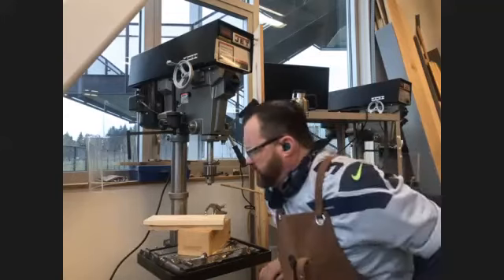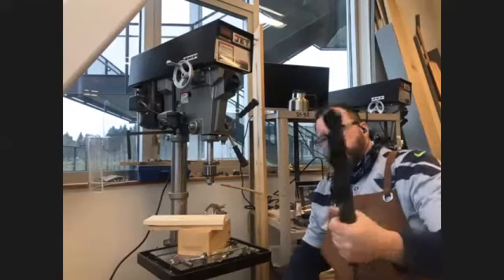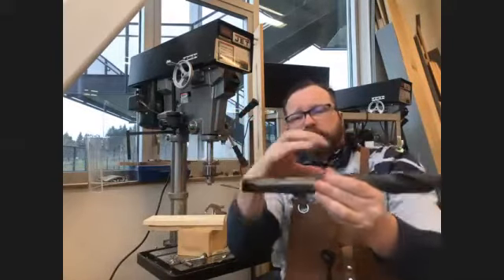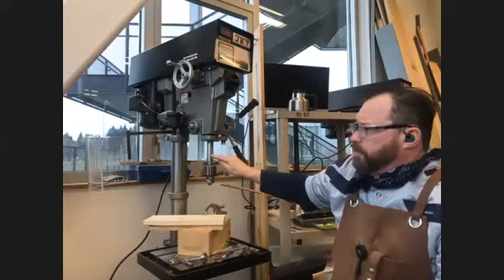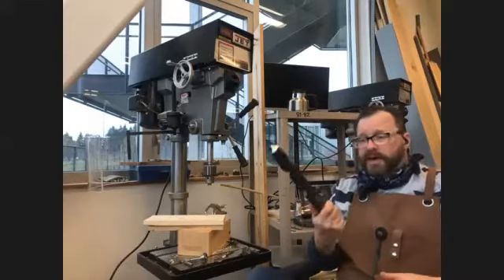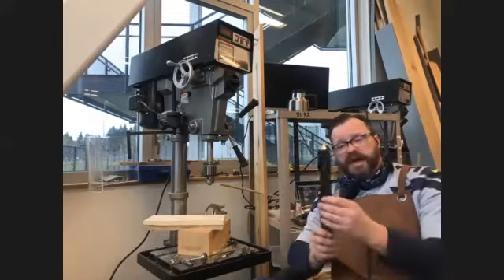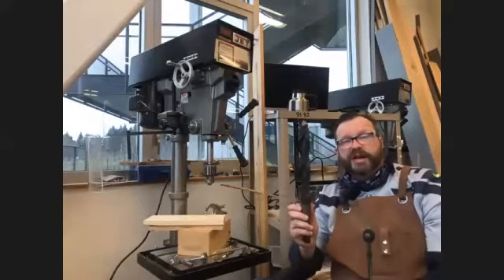There are many different types of drill bits. This large one is meant to go into a number two Morse taper — you can see it's larger and thicker here, so it binds into this portion of the spindle. My spindle is a number one Morse taper; I think this is a number two or three. This drill bit actually measures one and thirteen thirty-seconds inches, so it's really big — and probably a pretty expensive bit, likely in the $100 range for one size.